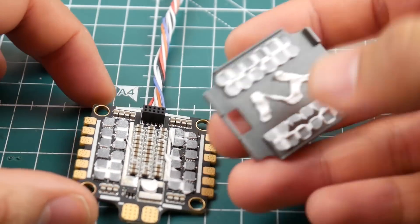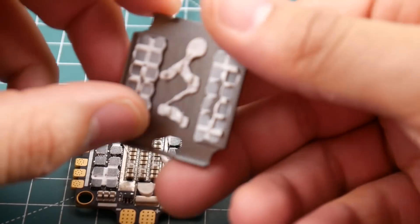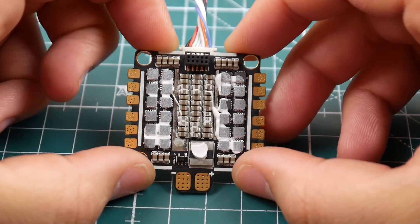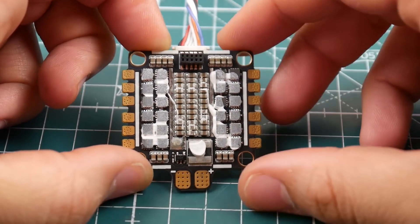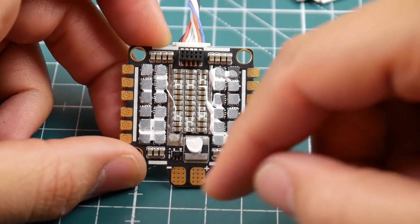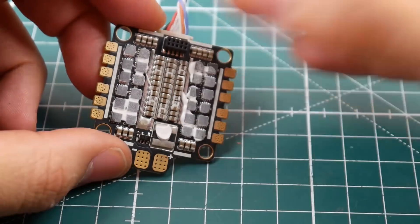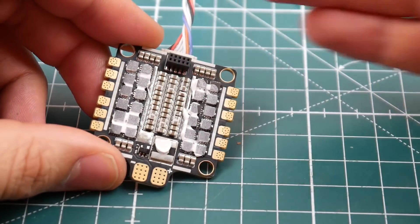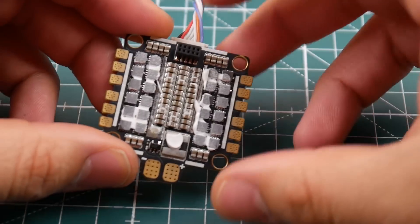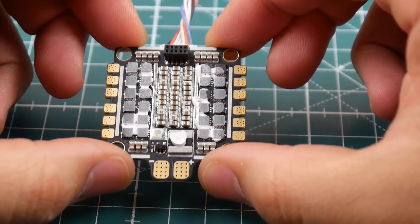Removing the heat sink was a bit tough, but I managed to get it off. It was held on with what I'd call thermal adhesive compound — it was pretty well stuck on there, so it shouldn't fall off on its own. Under the heat sink, you can see a large array of capacitors. They're very tiny but stated to be low-ESR. There's also a current sensor right there, and here are the MOSFETs — they're low-resistance MOSFETs, which in theory means less resistance in power delivery to your motors, so you get very good power down to your motors. I think that's enough talking, let's get to the bench test.